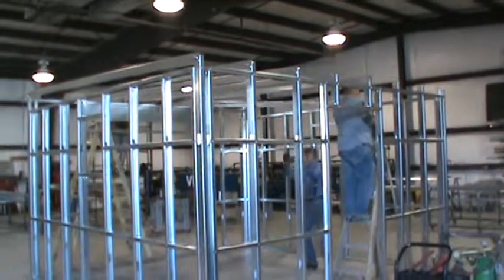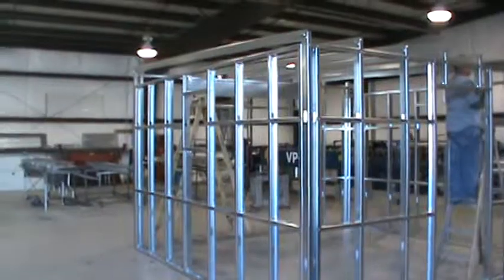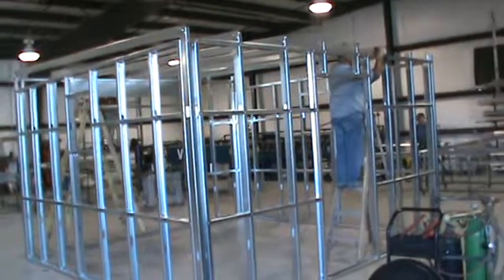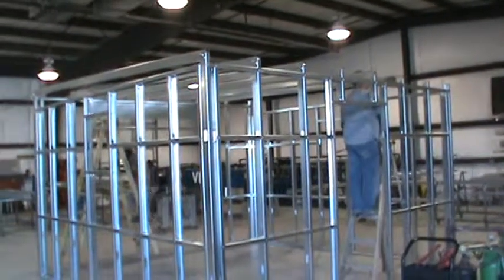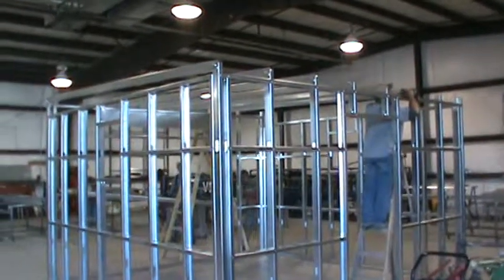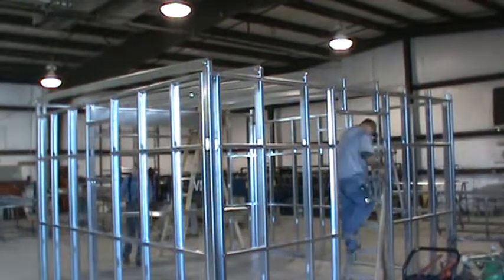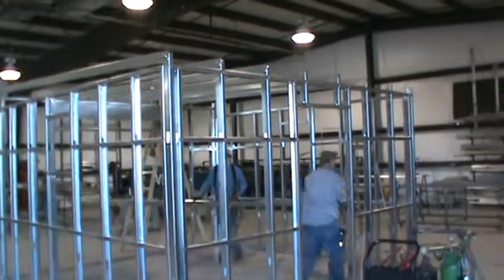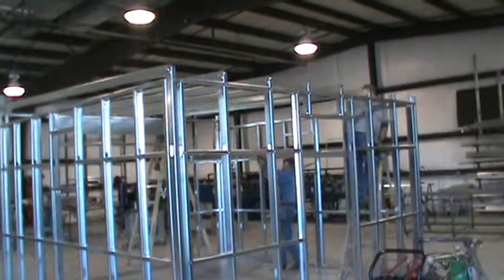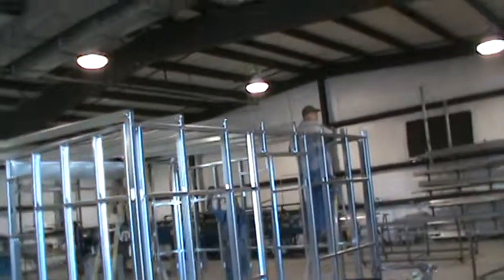The assembly of an already sheeted building, or an already sheeted and insulated building, is exactly the same. The only thing the customer has to do is stand the 4 walls up, screw them together, and then install the roof rafters and the purlins, and then the roof sheeting. Again, all the parts for the roof are pre-cut and marked with their appropriate locations. All the sheeting pieces, trim pieces, and framing members are cut to the exact length they need to be.